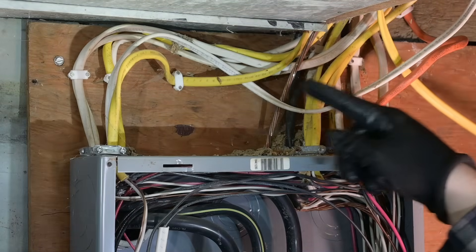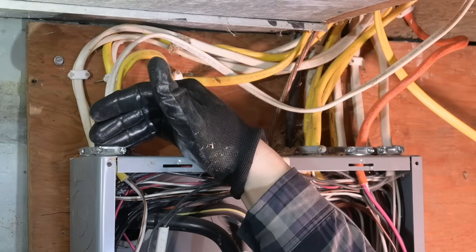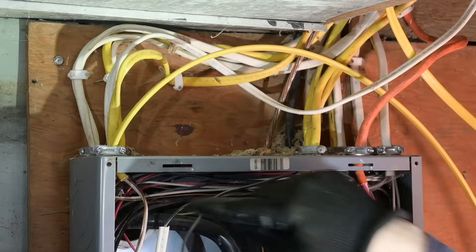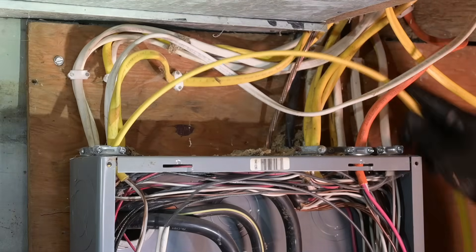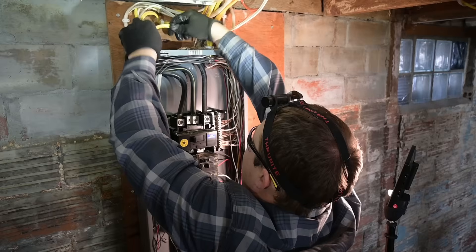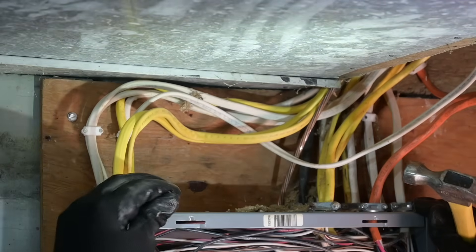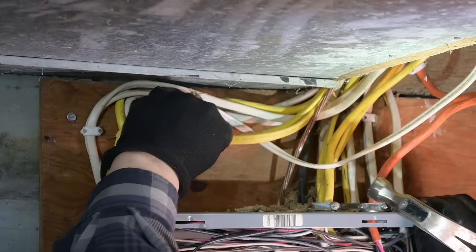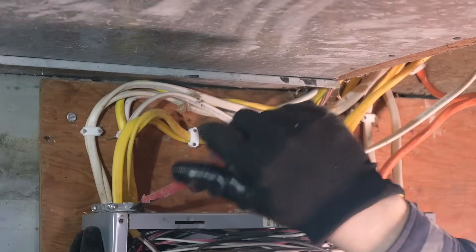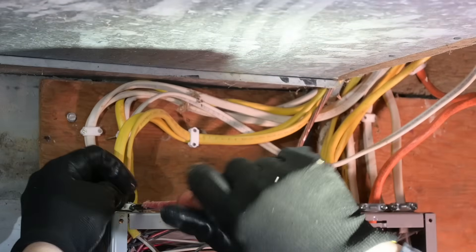Pay attention to how you're routing your cable above your panel. You need to anchor the cable within 12 inches of where it comes through or is clamped in place. Make sure that as you're pushing your cable in, you don't accidentally push it toward one of those live conductors. You can stack cables on top of each other — two assemblies together with one staple. Once the cable is stapled in place, tighten the cable clamp just enough to grab the cable, but don't overtighten it. You don't want to crush the conductors.